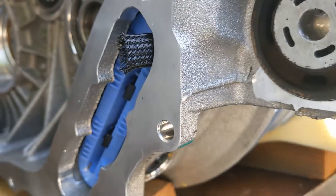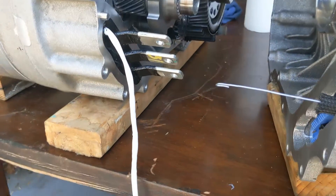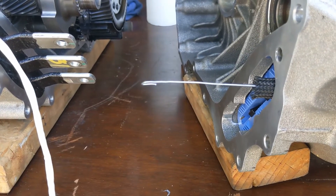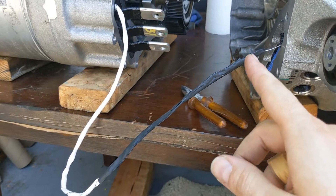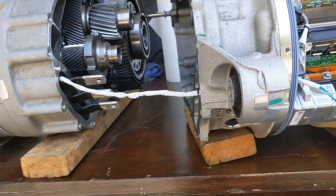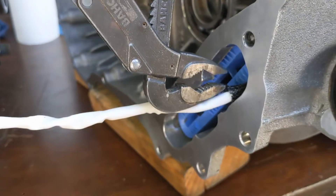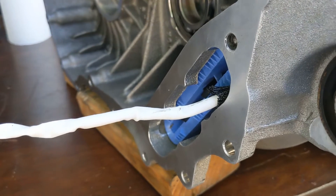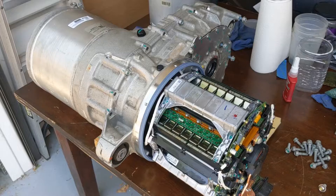Next I pushed a piece of metal wire through — make sure to first make the end round so it doesn't get stuck in the braid. I helix the wire all around the white wire and the green and blue wires and put protective tape around it, then pull it through. It's extremely tight, and when you pull it through make sure with tongs or something you hold on to the braid so you don't pull it into the hole and lose it. It's tight — but it fits. Nothing sticks out.